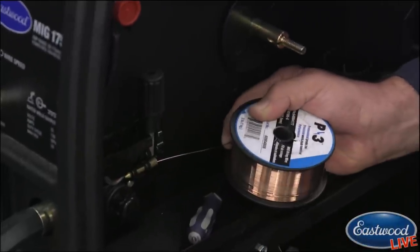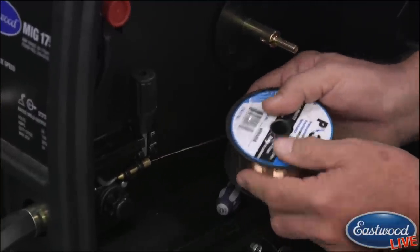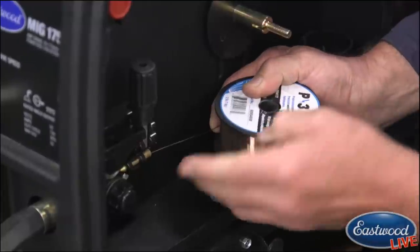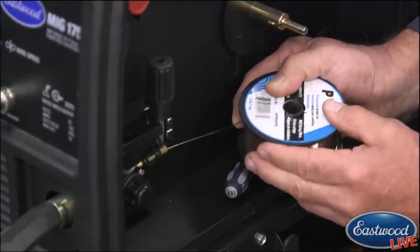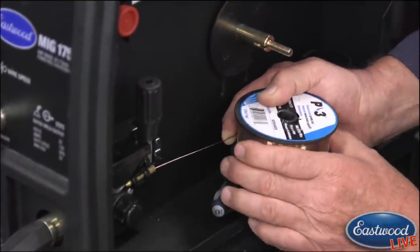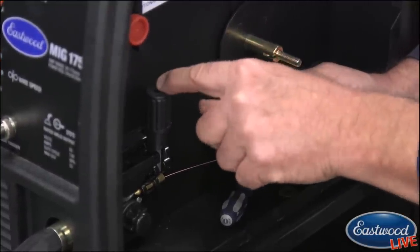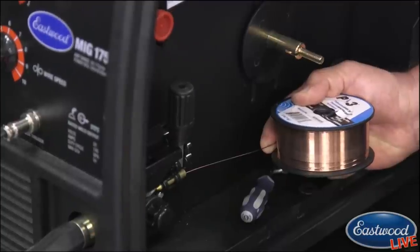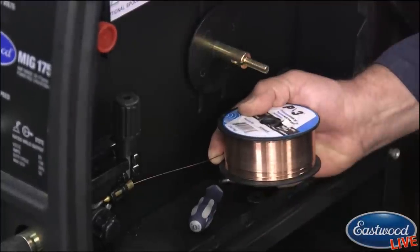Put the tensioner down and bring it up. Most machines are set from the factory. Here's how I check the tension: give the wire a tug — I'm pulling the whole machine and it's not sliding out. If it slides out, tighten it maybe half a turn to one turn. A lot of people crank it down four or five turns more than needed, which puts too much tension on the drive roller and flattens out your wire a little bit. If everything is set up right, there's no reason to have a drive roller problem.